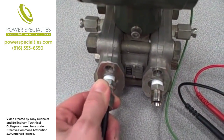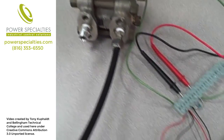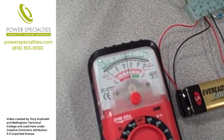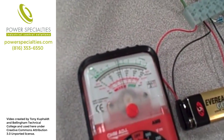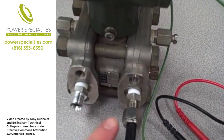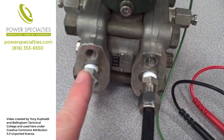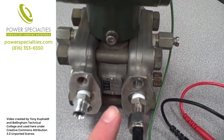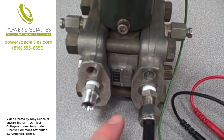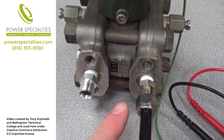If I take the tube now and move to the other port — the low pressure port — the direction of response will be different. If I apply a positive pressure to the low pressure port, notice how the voltmeter reading goes down. Applying positive pressure to the low pressure side flexes the diaphragm in the opposite direction compared to when pressure is applied to the high side. The transmitter interprets this as a negative pressure, and therefore the 4 to 20 milliamp current signal goes downscale — in fact, even below 4 milliamps if enough pressure is applied to the low side. Positive pressure to the low side drives the signal down.